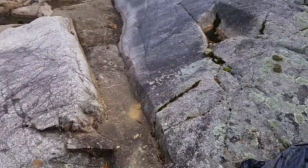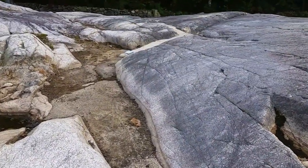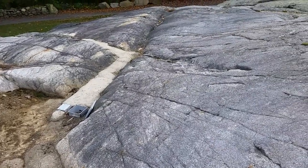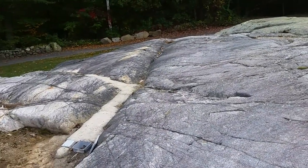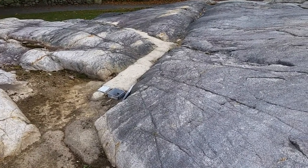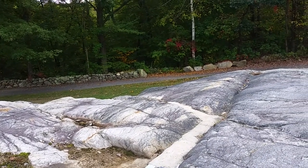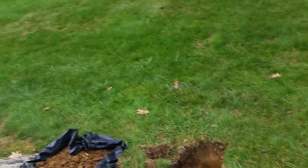What I didn't show you more of is that in fact it's encased in metal conduit in here under concrete, and then there's a pull box up here, and I had 80 feet of that underground cable sitting up here, right up in the air, so it was radiating and it was causing all kinds of problems. I took it and stretched it out over the far side. That helped. But having cable in the air really desensitizes your equipment horribly.